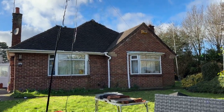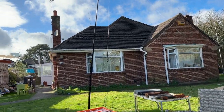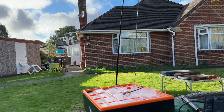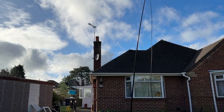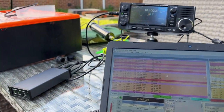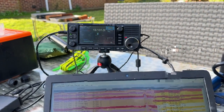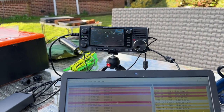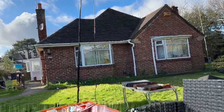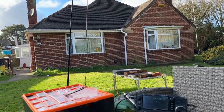I'm kind of shielded from the wind by the buildings. It's not overly windy — you can see the tops of the trees over there. I think this travel mast is a really good system. I like the fact it's got a ground stake that pushes into the ground without any problems, and the mast takes the weight of the dipole without any issue. The introduction of the choke filter and the tuner has given me the ability to operate FT8 with low interference back into the computer and the transceiver. So all in all, quite a good little experiment. Next time we'll see if the weather holds as we get towards spring — take her out somewhere nice and see how she performs on an actual POTA.